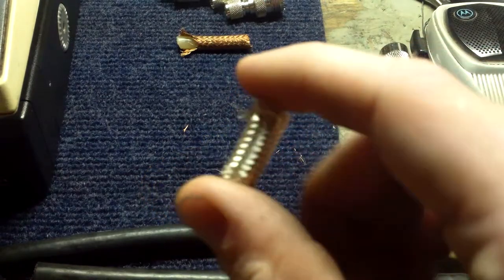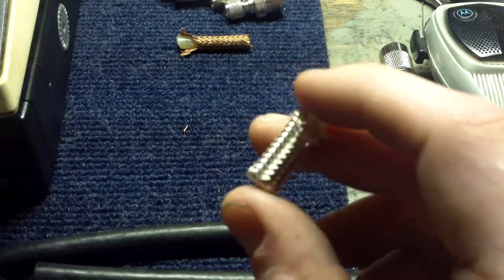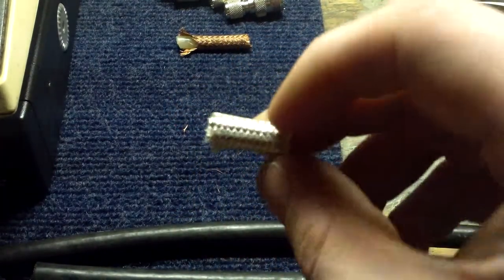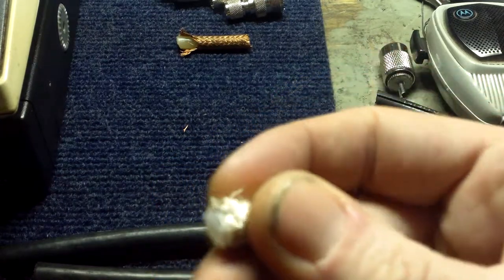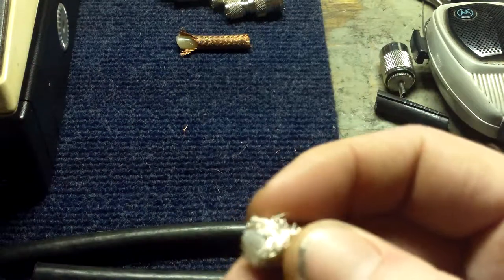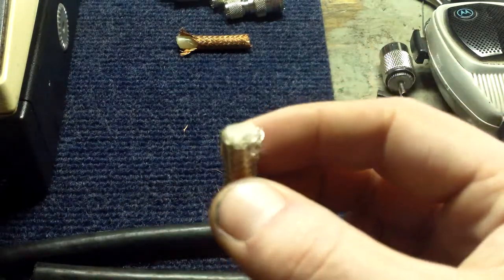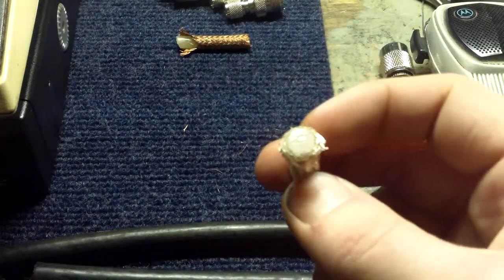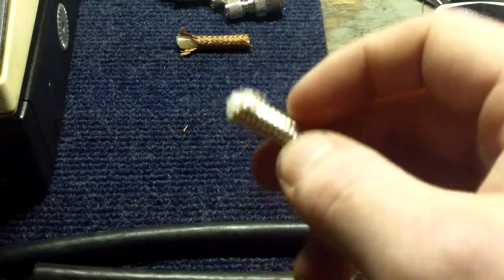This is what I'm replacing the jumpers on the UHF GMRS repeater — I have many videos on this channel. This is RG-214 mil-C-17D. You can see it's very tightly packed, silver-plated outer braid with a second inner braid that is also silver-plated copper. The center conductor is also silver-plated copper. The fact that this is marked mil-C-17D means it is the genuine article — really good coax rated for UHF applications.